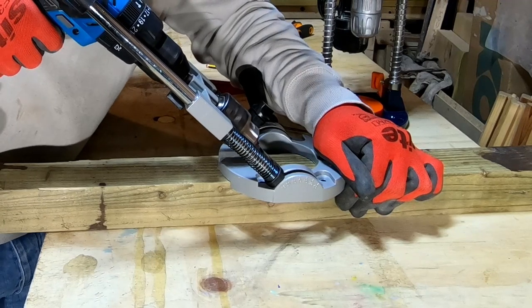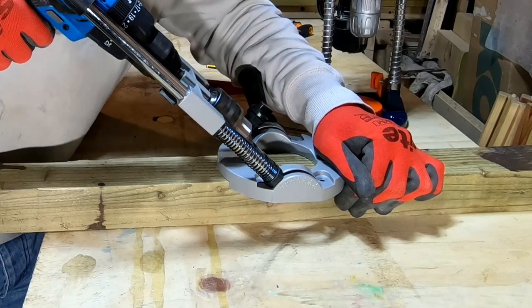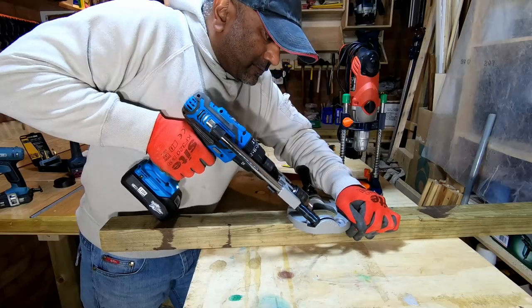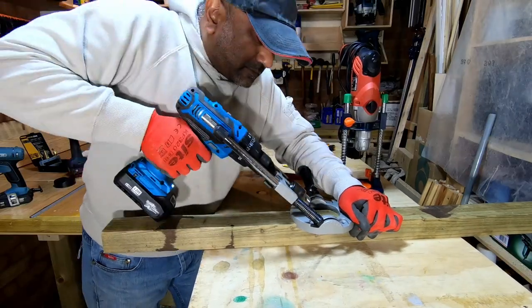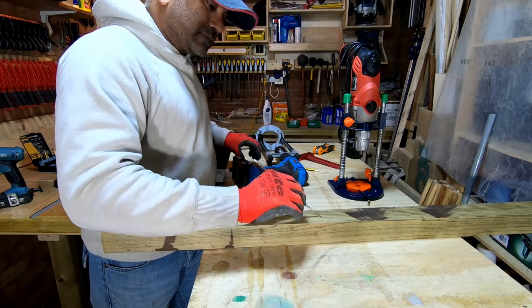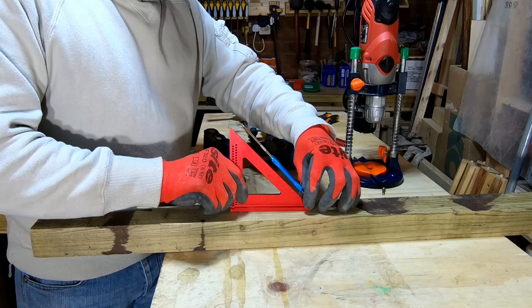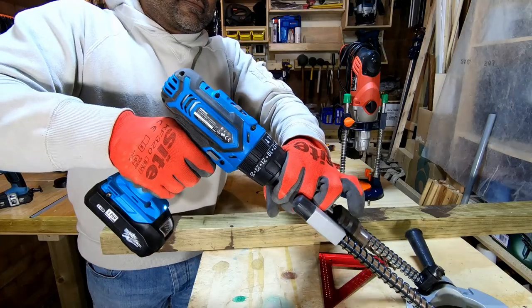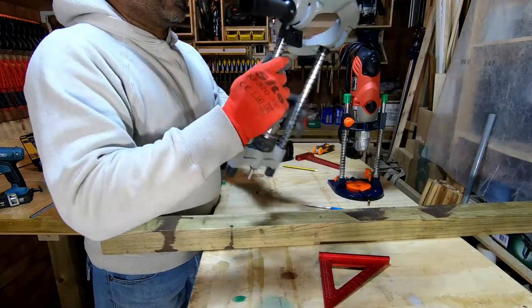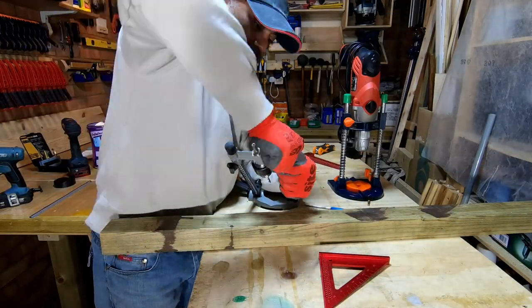To be honest it actually works better than I expected — I was expecting a bit of wiggle from the springs and the cable. To get it accurate, you have to make sure your workpiece is clamped and your jig is also held tight or clamped as well. With the 45 degrees done, I'm going to mark it back to 90 degrees and see how it performs.